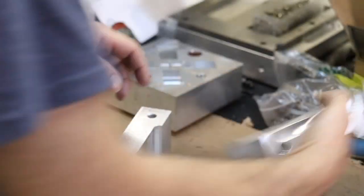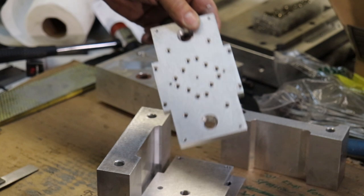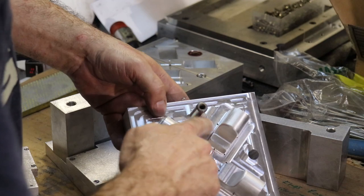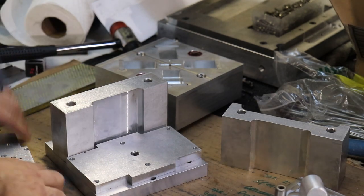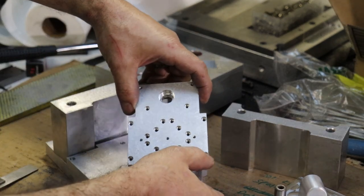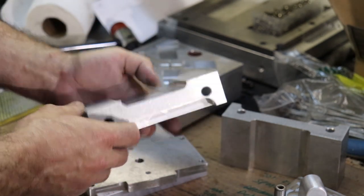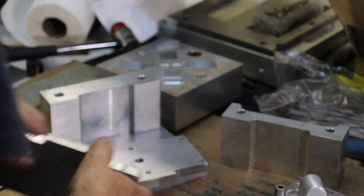Okay, so the next step is to assemble our ejector plate system, which you saw how I had to have a couple of outriggers because the parts are sticking kind of far out on the edges of our mold here. So this pin and this ejector pin and these little drilled holes, I need to basically compromise and put that little outrigger out there, which means that we had to machine a notch in our riser block or our rail to accommodate that little extra bit of ejector plate that we have there.